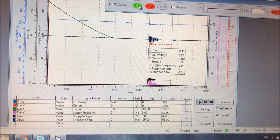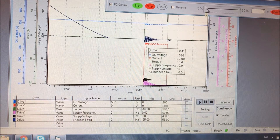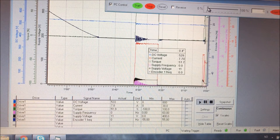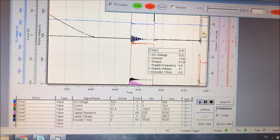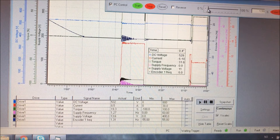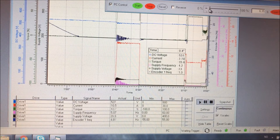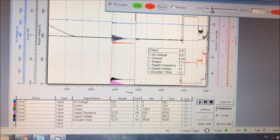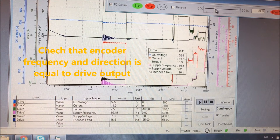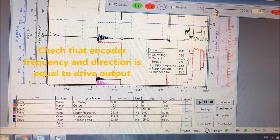The encoder ID run was successful. If I start it now, it is still in open loop, so the startup is a little brutal — it doesn't know the polar angle and isn't using the encoder yet. We can still see the current is quite high. Open loop is over-magnetized and not very efficient for running a permanent magnet motor.